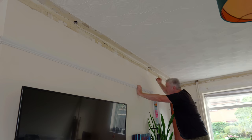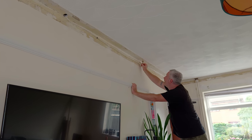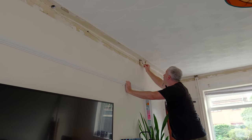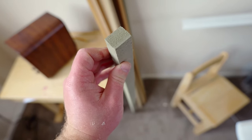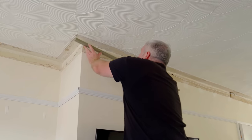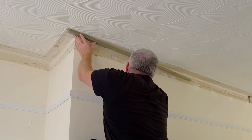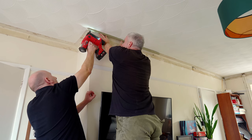The coving we're using is polystyrene, which is really lightweight making it easier to glue in place. Once all the 90mm guidelines had been scribed I can start using the 18mm MDF strips — gluing these in place to the ceiling so the front edge of the MDF meets that 90mm line, using a few 18-gauge brad nails to help hold it until the glue cures.